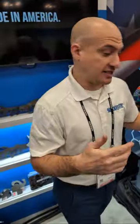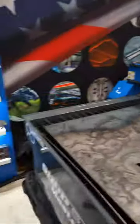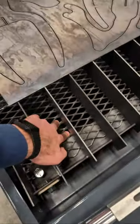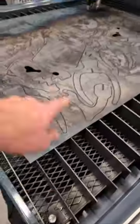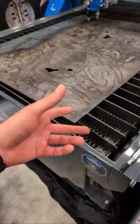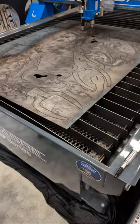And then this actually has the adjustable water table. Brandon just told me about this and I swear this was technology that only submarines had before. There's an air tank built in — essentially in the back of the machine there are two levers. You can raise and lower the table. You fill the water up, then raise it to the top so when you're cutting it's submerged. No smoke. Makes things nice and clean. When you're ready to retrieve those parts, drop the table, water drops down, you scoop your parts out — no more treasure hunting. This expanded metal here catches all your parts. You can see there's a deep table down in there. This one has quite a few gallons — like 1,600 gallons of fluid in this one.